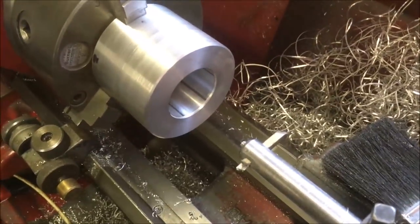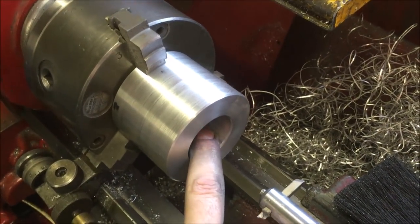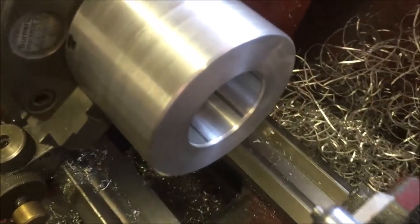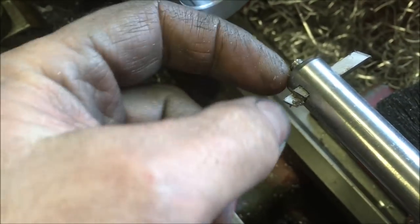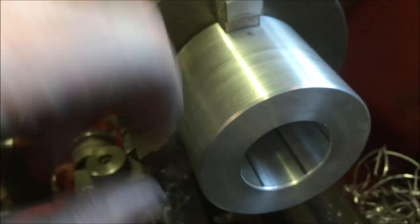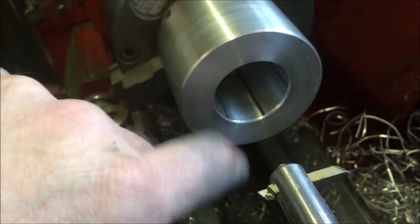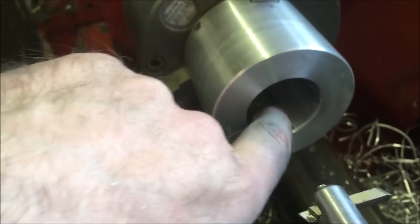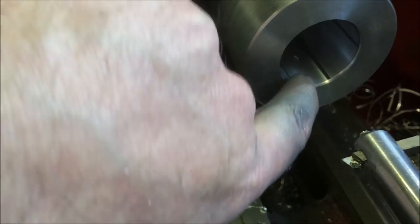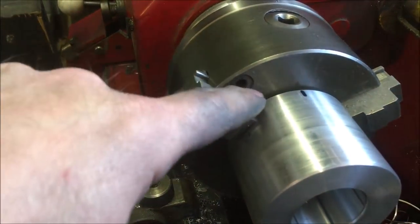So this is my hone based on Robin Renzetti's video. Basically, I bored that out to a thou. I think it's a thou oversized, but it's still got a little bit of heat in it. And then I've used a different cutting tool, a bit like a parting tool, and just scratched in 20 thou deep grooves, 6 of them. Apparently, that's what's needed. That's where the honing slurry sits in there and gets wiped up and embedded into the faces. I don't know whether 6 is enough. I seem to think Robin Renzetti's had probably 12, so I might do another lot, just half the positions. Anyway.